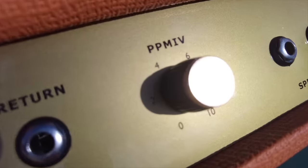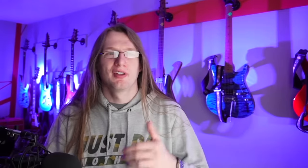I can't compare at this point because I don't have one with a master volume at the front — this is just a master volume at the back. Interestingly, on this amp the letters are arranged as PPMIV rather than the usual PPMV or PPIMV — so post-phase master inverter volume. It still makes sense, but it's a little unusual to see. But I don't care, because it does exactly what I need to make this amp usable: it allows me to crank the volumes on the front of the amplifier and get that crunch while not going completely deaf.